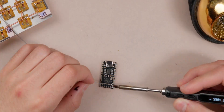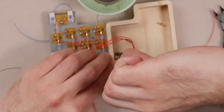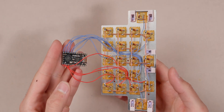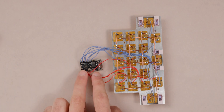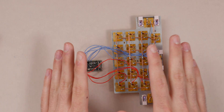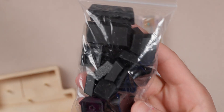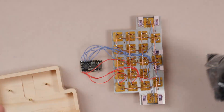Everything is wired up to the controller. I need to recompile the firmware for the RP2040, since it's currently set for the 32U4 Pro Micro — a simple QMK change that'll take about five minutes. Now I'm mounting the plate assembly to the five standoffs in the pine case. The keycaps are my Scotto Cap Scoop design, 3D printed in black filament, available in the repo. They're probably the best thing I've ever designed — I can get keycaps in any style or color I need.